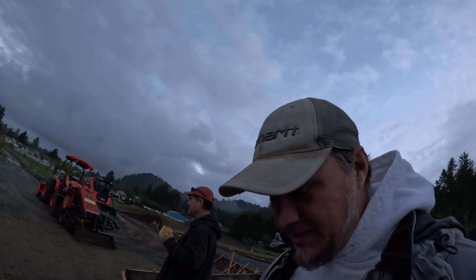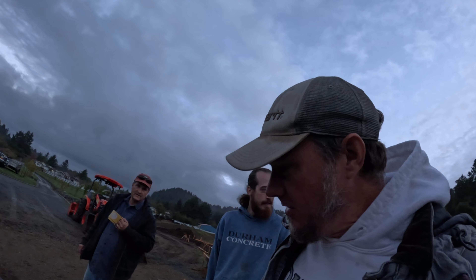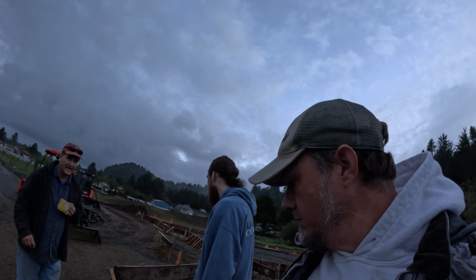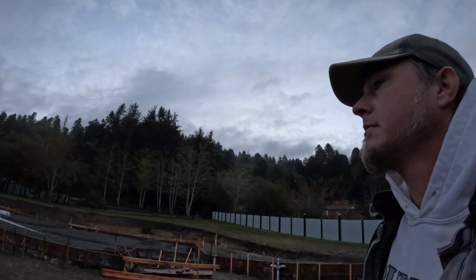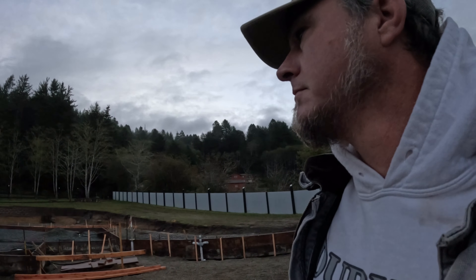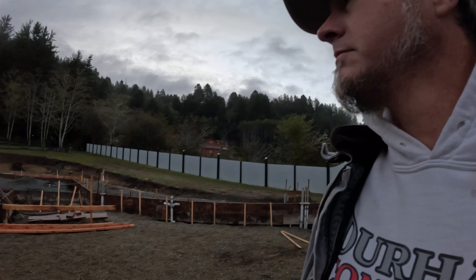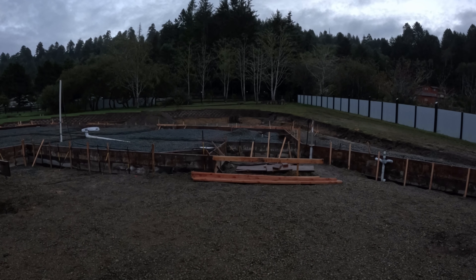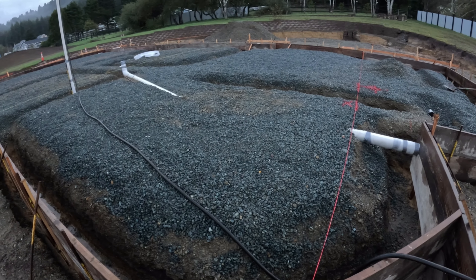Looks like Ted's got it all figured out. We're going to put some walls up, get some rebar in there, get all the number four bar in. I mentioned to Ted — if we put in a couple of number four bars in all the structural footings on Dobies, it's probably smart to do that before we do any installation. Get the footings still in, because around all the edges I'm putting in that thin mylar, and it'll tear up if we're in there too much.